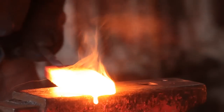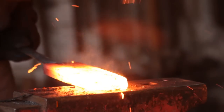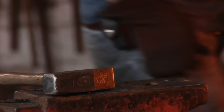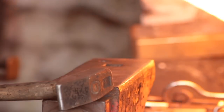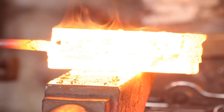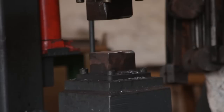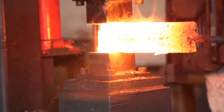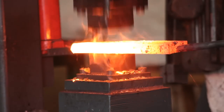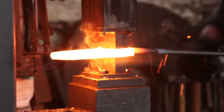You just have to do this a few inches at a time and be careful to hit every surface in order to make sure it welds. It does take a bit of practice — I've cocked up quite a lot of pieces over the years, but right now I'm at a stage where I'm reasonably confident with this. With it all tack welded together I'll head over to the power hammer and make sure that weld goes in. Because the power hammer hits nice and square over a wide area and fast, I'm doing bigger areas with the welding heats.